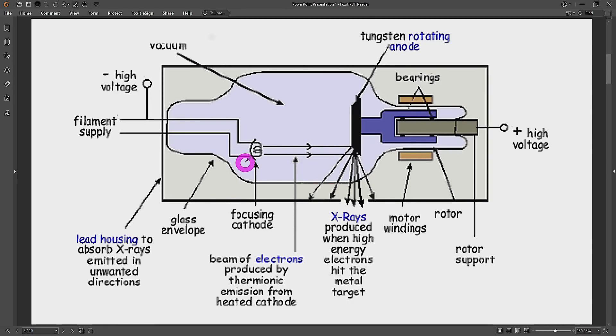Here's a crude drawing of an X-ray tube. To produce X-rays you need electrons accelerated through an electric field, then slammed into a tungsten plate — that collision produces X-rays. The whole thing needs to be in vacuum, so the architecture isn't very complex, but there's a lot of art in making the tube. You have a filament, and once you heat it up you get thermionic emission. These electrons can then be focused toward the target using a focusing cathode, which is voltage controlled.